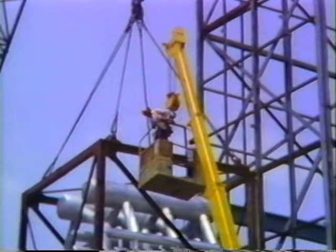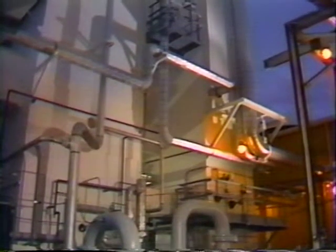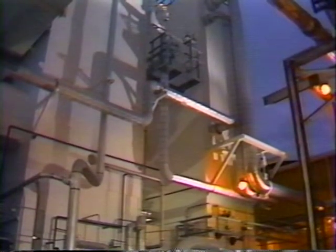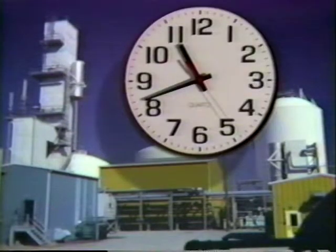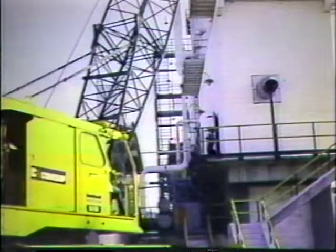A crane with a work cage can assist in the removal of personnel during an emergency, but it is often limited by the work area. If you're trapped on top of a platform between two cold boxes and there's no room to safely position it, you could be in for a rather lengthy stay. Additionally, a crane may not be stationed at the plant site. It could take hours before one is brought to the site, and it still may not do the job. Thus, the use of a crane is not reliable for emergency planning.